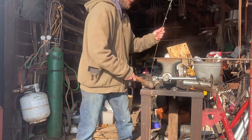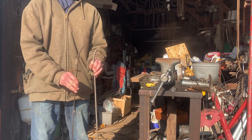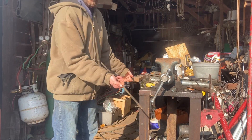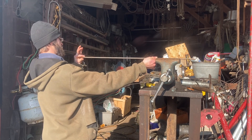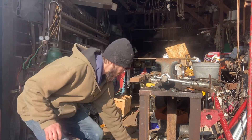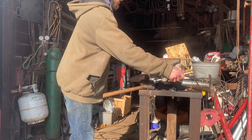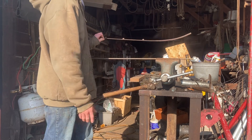Still got to go a little more. We want the back bend to be pretty close, so we'll line them up again. We can see the bend in mine starts right about here. I'm going to put that mark in my vise and make sure this back part is level — I want it level across so this bend ends up being straight with the bend in the front. We'll take the hammer and bend it ever so slightly — these are real gentle bends. Move it about an inch and bend it again; just lay this over the top until you recreate this bend as close as you can. We're done with this one.